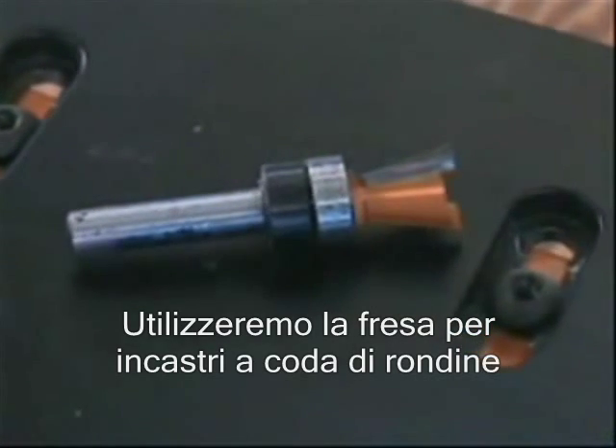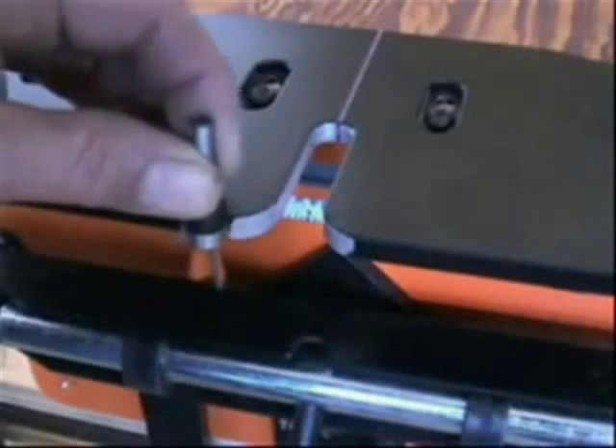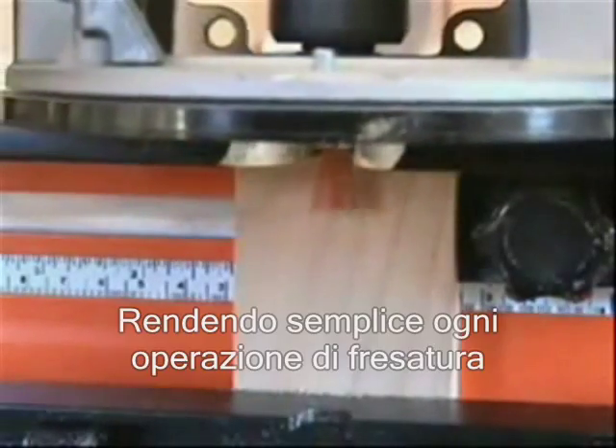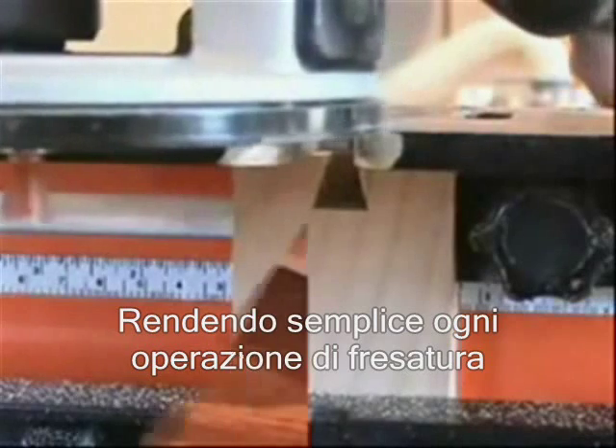At the heart of the N-Lok Jig is a pattern-style dovetail bit. The bearing on the bit rides in and out of the dovetail socket guide in the N-Lok table, making it very easy for you to cut perfect dovetail sockets every time.